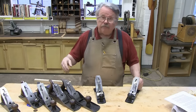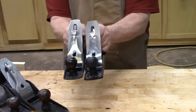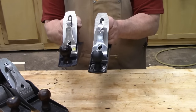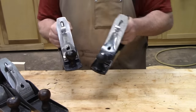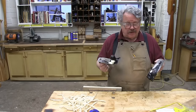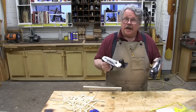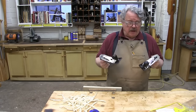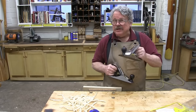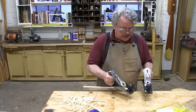The Central Forge plane is obviously a smoothing plane. As you can see, it's a knockoff of the Stanley number four smoothing plane, not a jack plane like the packaging claims. That must seem like a lot of effort just to prove that the guy who wrote the packaging got it wrong. But if you're going to get this thing to work, you've got to understand what it was intended to do. Speaking of which, let's see what it does straight out of the packaging.